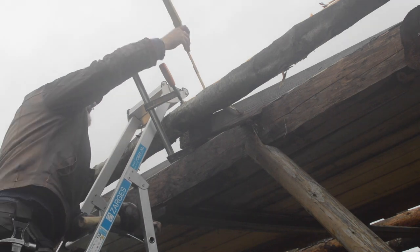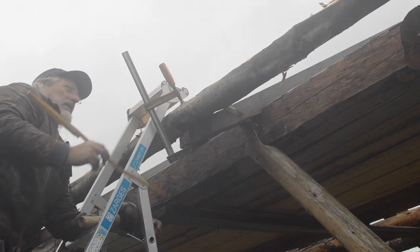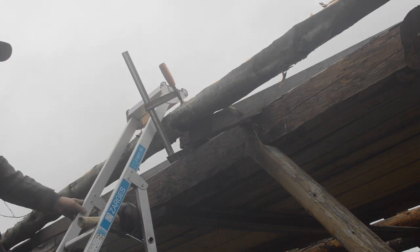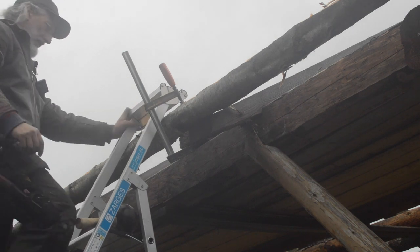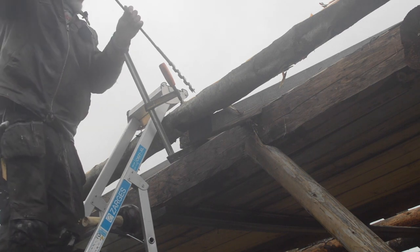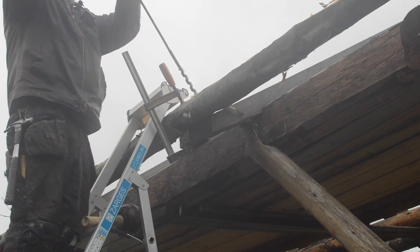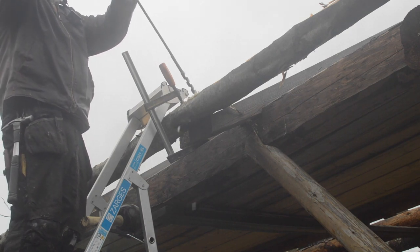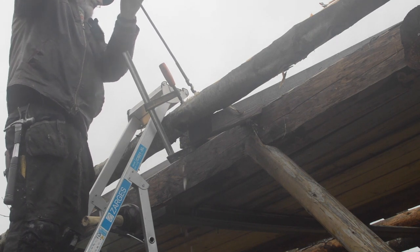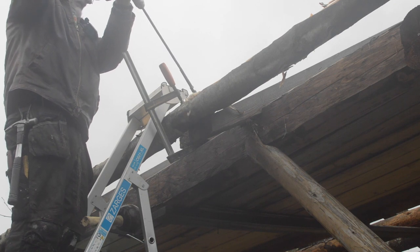All I'm after there is a 9 centimetre thickness down onto the joist. So that's about 9.5 now, so that just gives 0.5 centimetre to go off with the power plane a bit later. Now that these two are clamped together, it should be a little bit easier to drill, because the swarf gets caught between the second piece of wood.